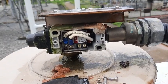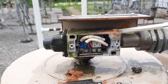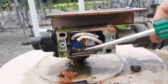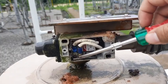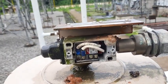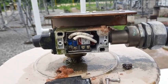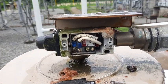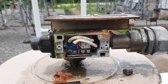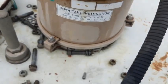For maintenance of PRV, at least once a year you should open and clean the terminals. Otherwise, if an insect gets inside or moisture gets in, the two terminals can get shorted and you'll get false tripping — the PRV did not actually trip but you get a false trip indication. To avoid that, it's always important to clean this at least once a year, depending on the climatic condition.